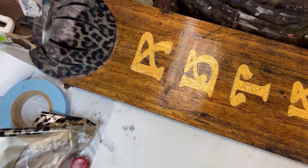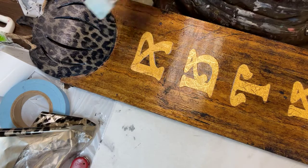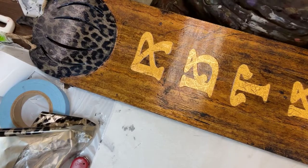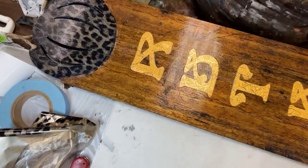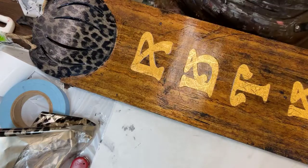This has nice self-leveling properties. So this will lay out, again, what I stressed before. Half of the problem most new painters have with streaky top coats is that they come back and work the product and they brush and they brush and they brush. Don't do that. Brush it on, smooth it out, leave it alone.